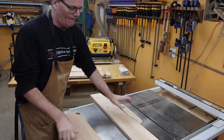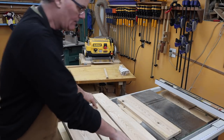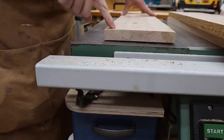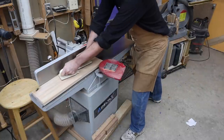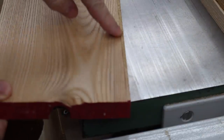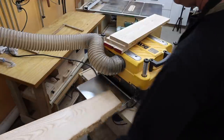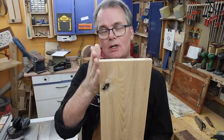So this is the wood I'm going to be using — it's ash, as I mentioned, and about a week ago I planed it down to seven-eighths of an inch in thickness. I got this board from a buddy of mine and it had been in his barn, so I wanted to make sure it had plenty of time to rest. Oh yeah, look at this one — a week ago this was flat. That's another kind of wood movement, so I'm going to have to spend some time on the jointer before planing some more. These boards are a little bit wider than the capacity of my jointer so I have just a little ridge here along the side that I will be taking off with the block plane. After planing to desired thickness I took them to the jointer to edge one side and then over to the table saw to rip them to final width.